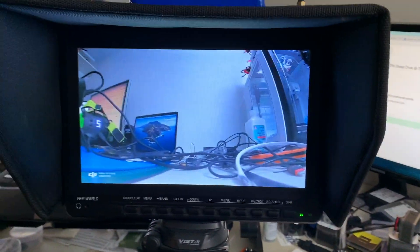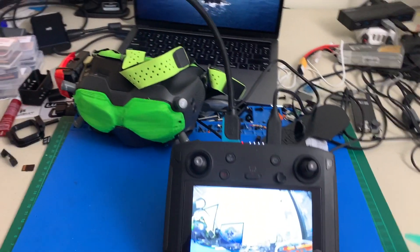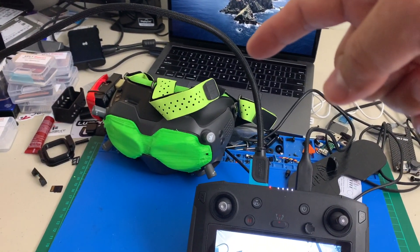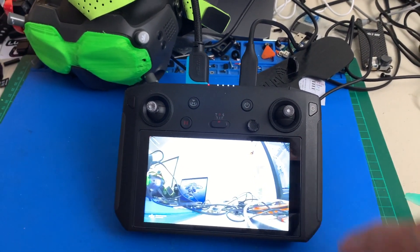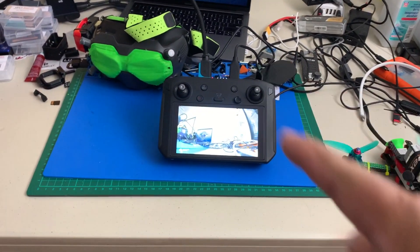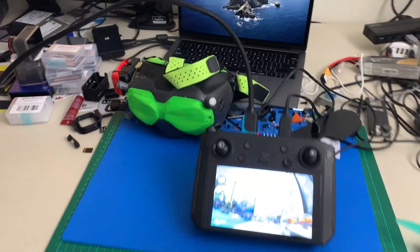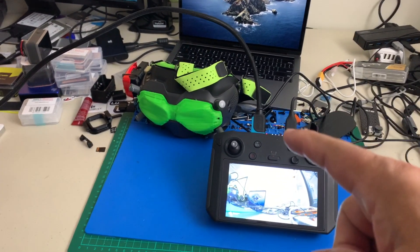That's it — that's how you set it up with the latest DJI firmware. There are two firmwares: one goes into the FPV system, and the latest one that just came out goes into the smart remote — firmware version 1.00.07. Once you have that combination on both devices, you can live stream while you fly around. This doesn't have to be wired to the quad; you can fly freely as long as your goggles are connecting.